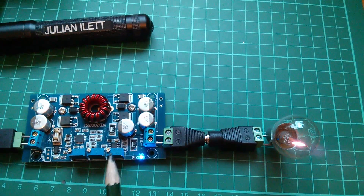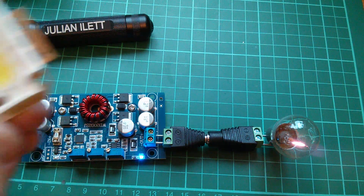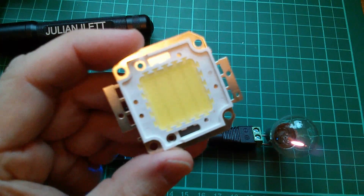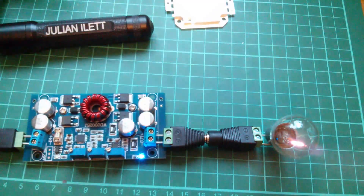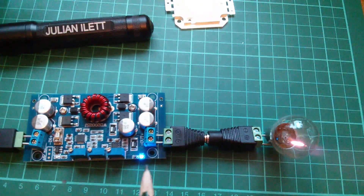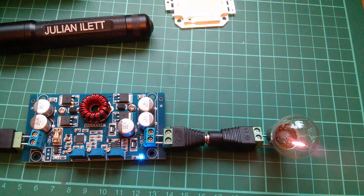Because this unit has a current-limiting potentiometer, it would make a perfectly good LED driver — except that most high-power LEDs have 10 LEDs in a column, requiring around 33 to 34 volts. This 30-watt LED and this 100-watt LED both have 10 LEDs in a column, and the converter only reaches just under 30 volts, so it's not really suitable as a high-power LED driver.